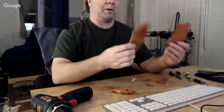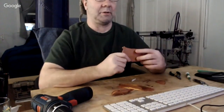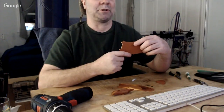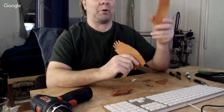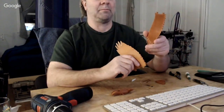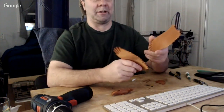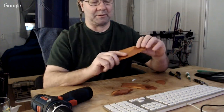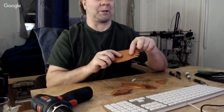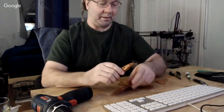When you print these things — I should start with that — the wings need to be really heavy; the heavier you make them the better. These weight holes have been my biggest problem. I print these at four top, four bottom, 40% infill, four shells — all fours, pretty easy to remember — at 0.2mm layer height. The four shells and four top/bottom makes all of this from the taper outward pretty much solid plastic, making it nice and heavy so it balances well.